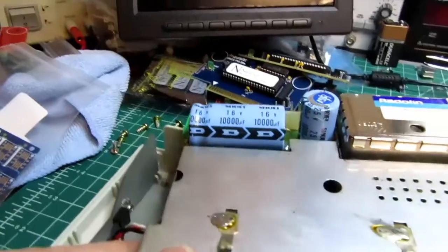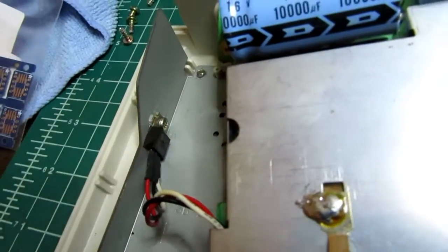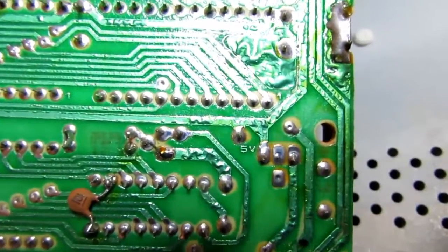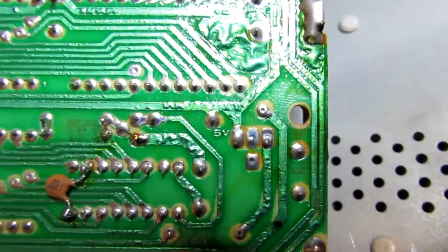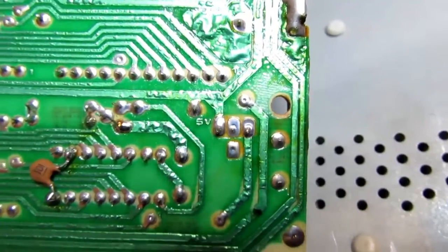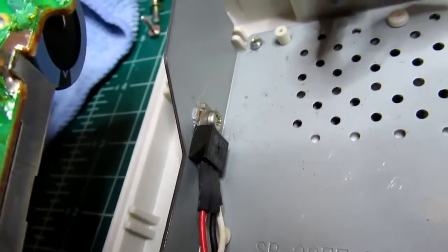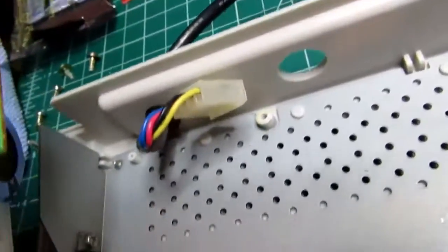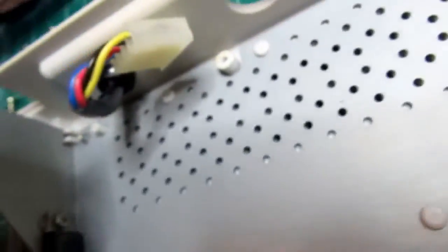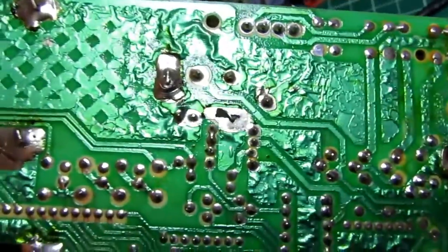Somewhere down there these power supply wires go down under the can. I just have to isolate where the 5 volts is. And I did verify that's a 7805 down there. Look at that. They helpfully labeled the trace as 5 volts. So right there in the middle of the picture is the 5 volts. It's right next to one of 3 terminals. So it looks like originally they had the circuit board laid out to maybe put the 7805 right there on the board, and then decided to relocate it. But on the other hand, there are stampings on the frame that make it look like they intended it to be there all along, so I'm not sure. Anyway, it's pretty clear they just have 3 wires soldered into those 3 pads, and then they extend out here. So it should be pretty easy to trace that 5 volt signal up in this general neck of the woods and tap off of it.